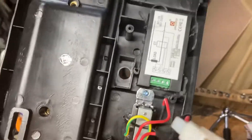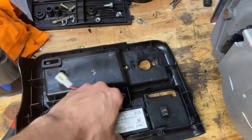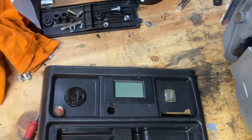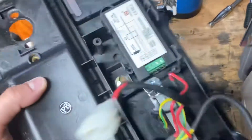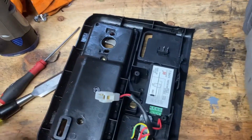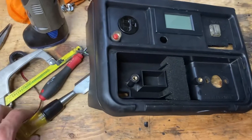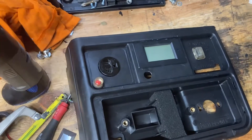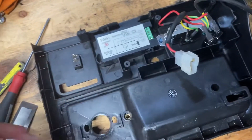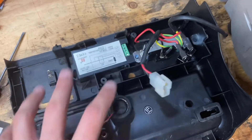Got the meter snug in the front panel. I think it came out pretty nicely - a few apprentice marks around the edges but the back looks pretty good too. What I ended up doing was tracing around the interior dimensions on the front, then used the Dremel to cut that outline out, which gave me an idea of what I needed to remove on the back. The other tools I used were a handheld hacksaw for areas I couldn't access with the Dremel, and a chisel was great for paring the edges and cleaning up burrs from the Dremel cuts. It's in there nicely - now I have to wire it up. I need to add the toroid, the Rogowski coil or whatever this is, and also get some two-wire to connect to the hot and neutral line.